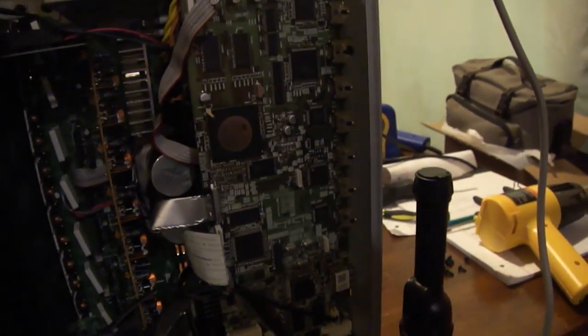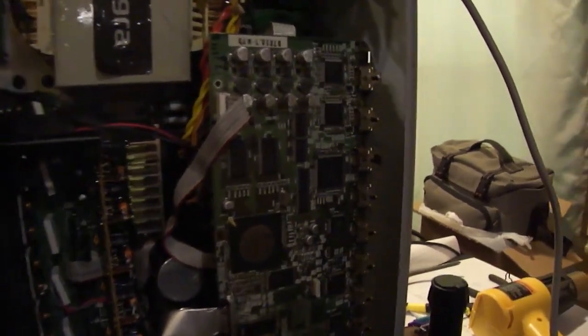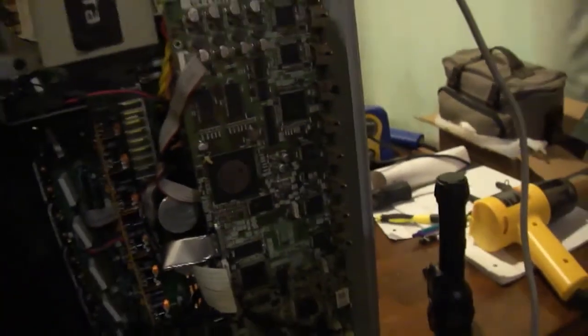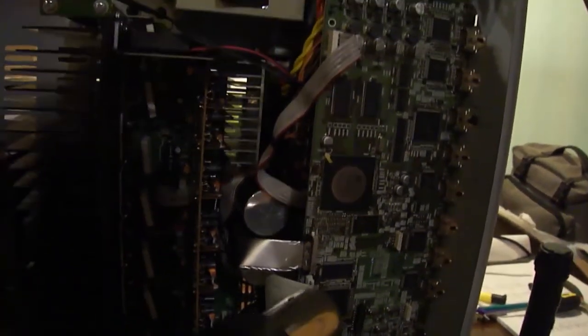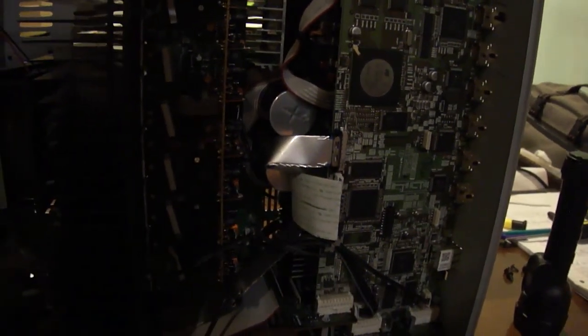I went ahead and ruled that out, even though most people wouldn't, because you hear two clicks. You hear the standby relay, and inside this unit, hiding down in here, there's another pair of relays. Those are the protection speaker relays. See, listen. Click, click, click, click. So I know it's not in protection. I heated the DSP up, I heated the memory up, it didn't make any difference.